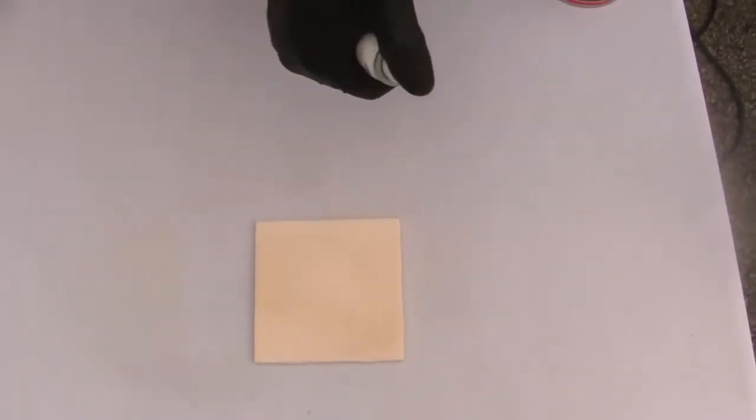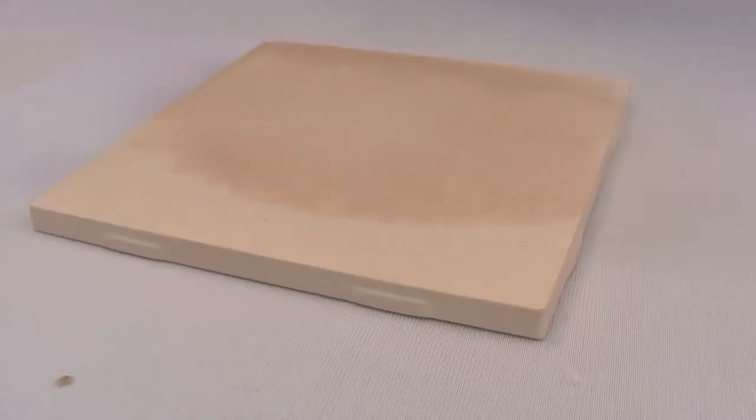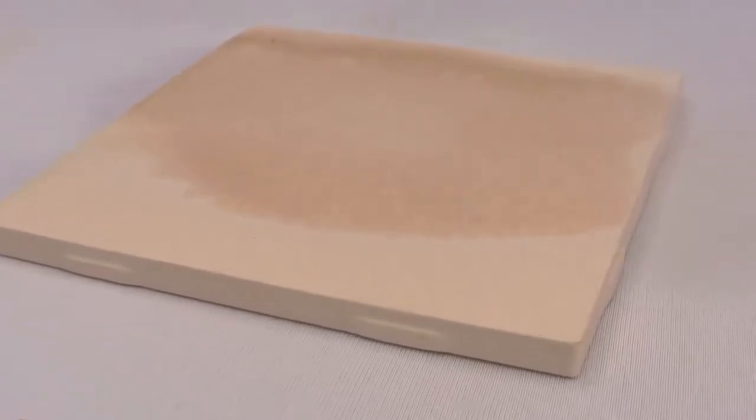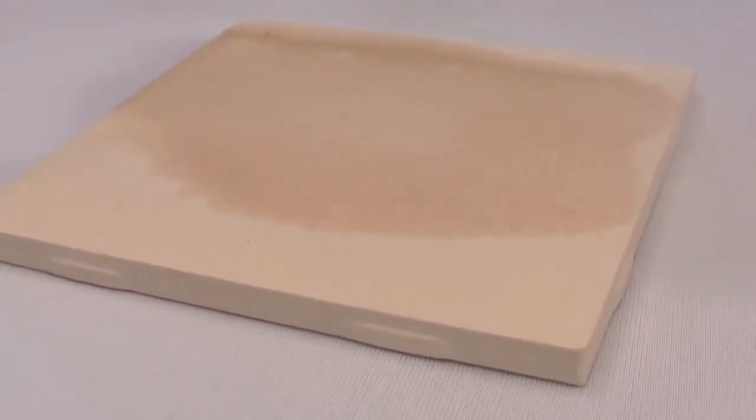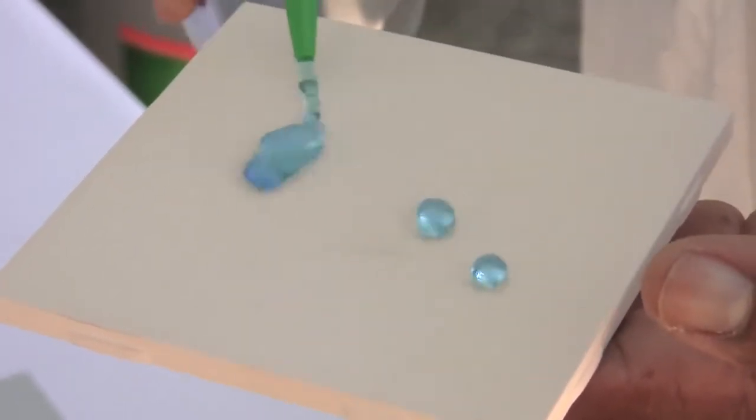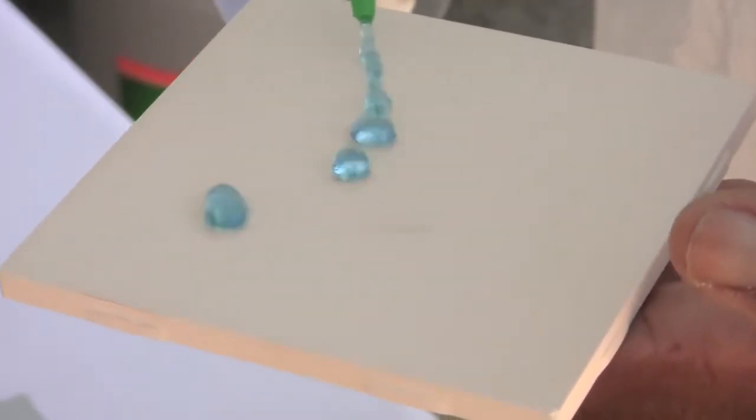In a similar fashion to the bottom coat, apply the top coat in multiple thin, uniform passes. Allow the top coat to dry for 15 minutes for initial water repellency. Allow it to dry for 2 hours prior to packaging or handling. Allow it to dry overnight for maximum abrasion resistance and water and oil repellency.